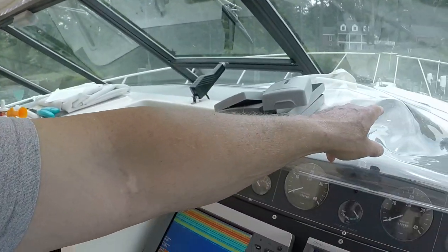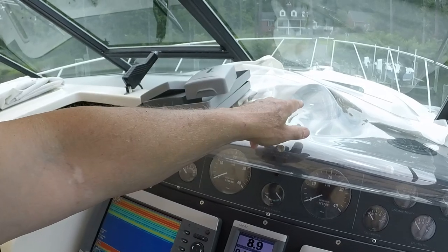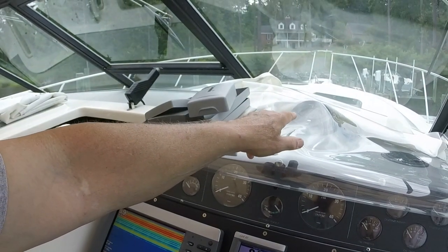They're connected by basically an Ethernet cable, and several of the devices are on what is basically an Ethernet network. Literally uses Ethernet cables and RJ45 connectors. The cables are actually crossover cables too, so that's a little different from your normal networking cables. I am going to change the networking protocol for the compass from NMEA 0183 to NMEA 2000.